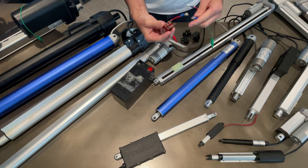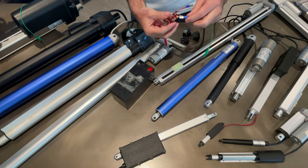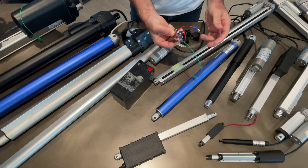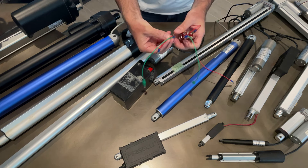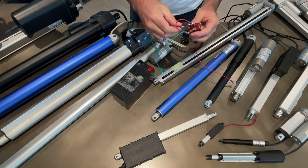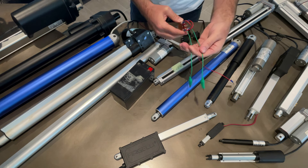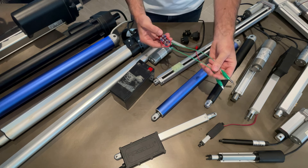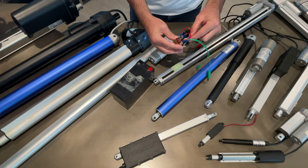Let's quickly hook one up so you can see. We add the wires to the actuator - one to each corner of the switch. You add one to that corner, one to the other corner. We have another one with a pigtail so we splice them. One goes across to the other corner - these two will go to the actuator with alligator clips - and the two center ones will go to the power source.